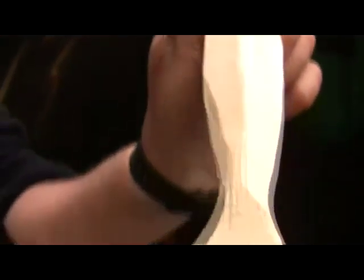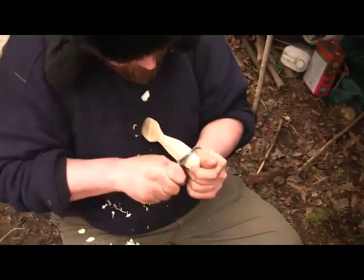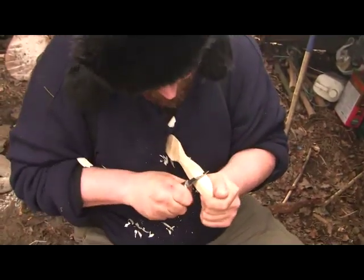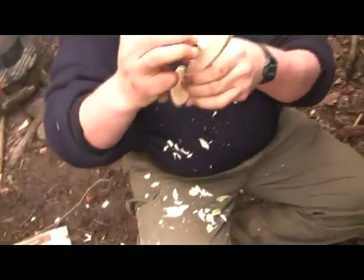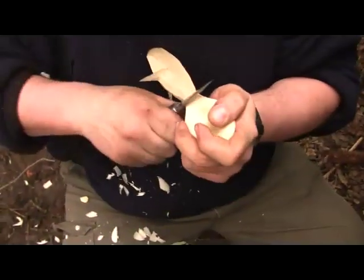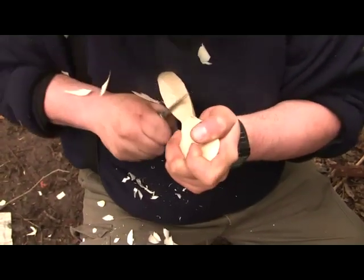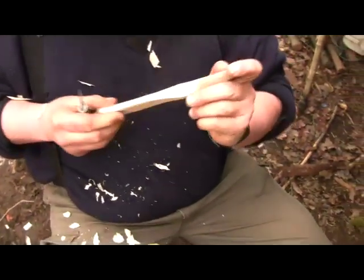That's why in my mind it's quite nice and smooth. Compare that to this side — I'll try and get that ridge going down the middle. Once we've got the top surface, sometimes you'll find that it's starting to tear. You see that it's tearing? That means it wants to work the other way, so instead of fighting it you give in straight away — fair enough, wood, I'll come from the other side.